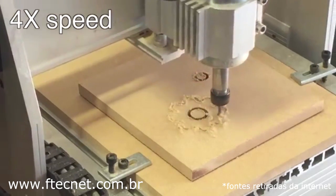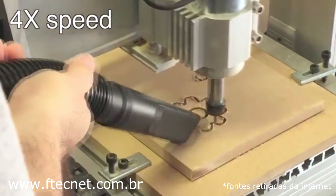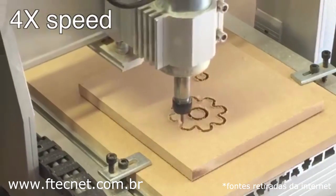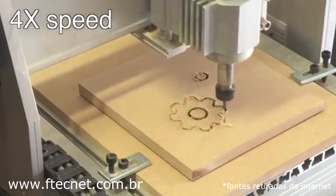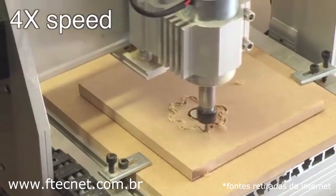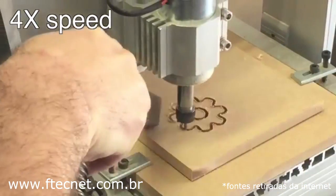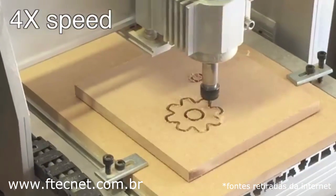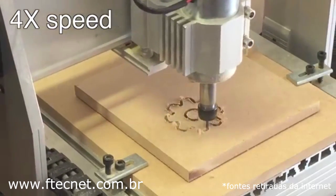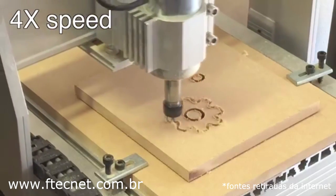I went ahead and arranged them on the pallet that I had, which was a 7x7, representing the length of my cut board — a 7x7 block of MDF, half-inch thick. I also added the tabs. If you notice, as it's traveling around, you might be able to see the Z-axis of the spindle kind of bump up slightly as it goes over the places where the tabs are actually inserted. Those help keep the material anchored to the waste material so the pieces don't fly out across the room.